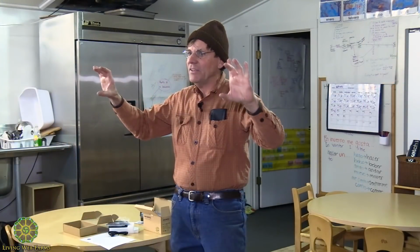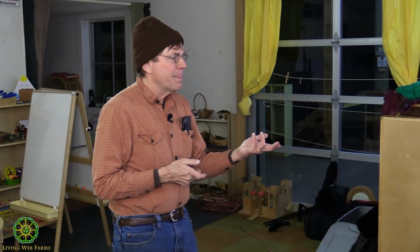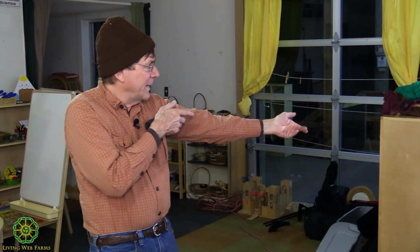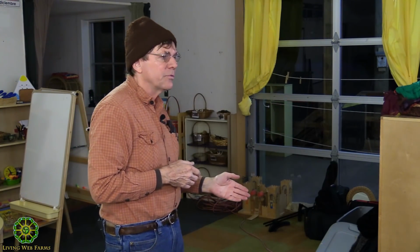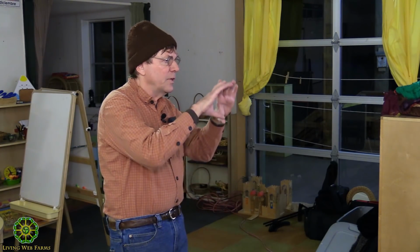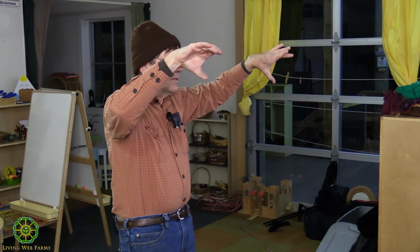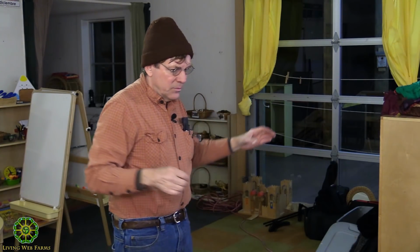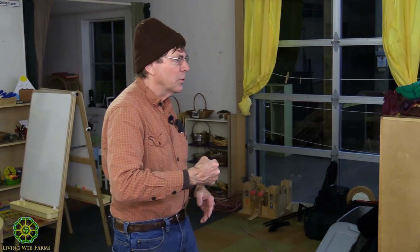I really wanted a flat face for the door to shut up against. Now the Trex is heavy, it's dense, and if you take a piece of lumber and look down it when you buy it, you don't want one that's warped. A lot of people, you'll notice them in the store, will sight it, make sure it's reasonably straight. And this stuff is very straight on its edge. If you turn it on its edge, it doesn't bend. But if you lay it flat, it just waves. And to take a piece 80 inches long and use that as a frame member that you expect a door to close against and make a seal is a very high expectation.